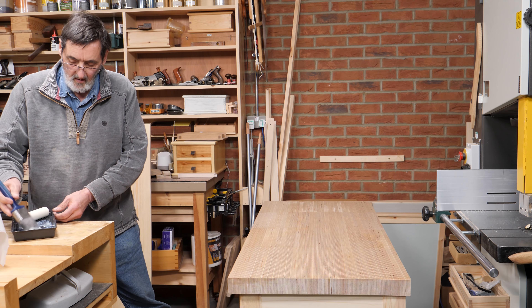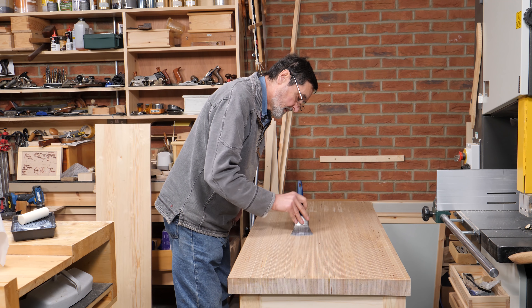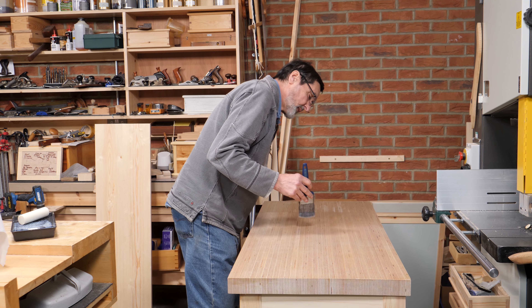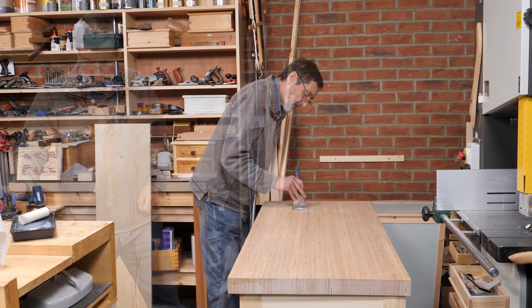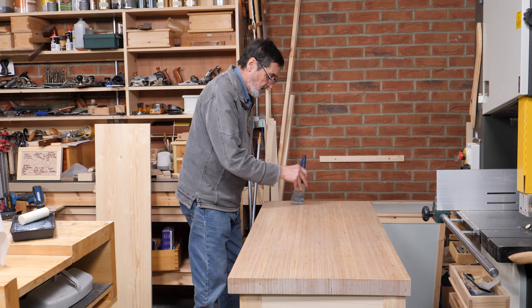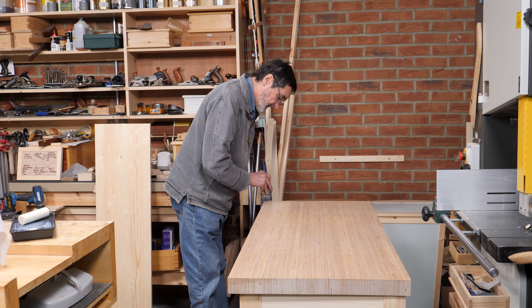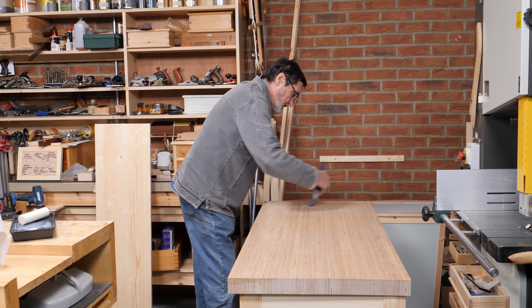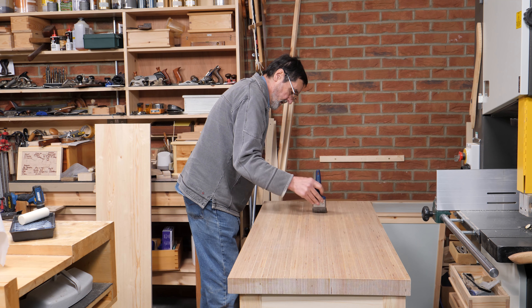The brush is looking a lot smoother than I would get with the roller, which I expect. No gaps. This is great experimenting on the underside of a project like this. That's the other thing I like about this water-based, or water-borne, finish — the surfaces are remarkably hard. They seem less flexible. I've seen some amazing water-based finishes for guitars and stringed instruments — remarkable. They look so deep.